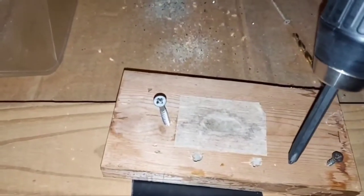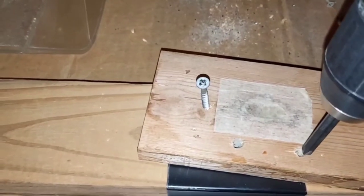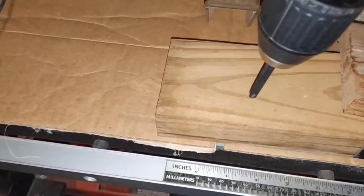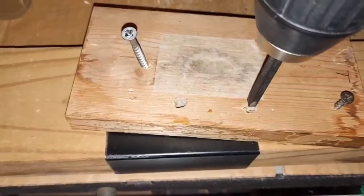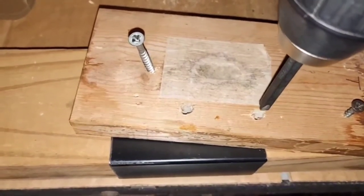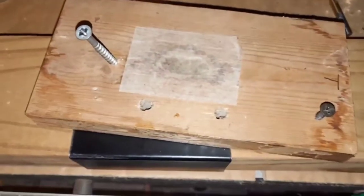Now you can come along with your drill. Tighten this one down, make sure it's still in the viewport correctly, then take your drill and go straight down — keep it perpendicular and start drilling. It helps to put your hand right here and hold the whole mechanism in place, or clamp this two-by-four down. You'll feel it when it bites because it'll get a little harder to push — let up on your pressure. When it grabs that metal it's going to try to turn this clockwise, so just keep a good grip. As soon as it breaks through the metal, it's easy — just pull it back out, clear your hole, and undo the mechanism. It usually keeps your hole pretty good and straight.